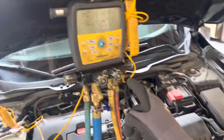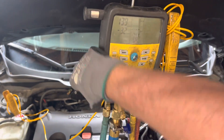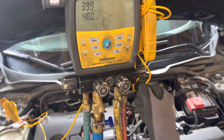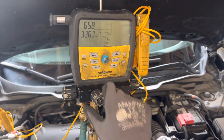So now I'm going to run nitrogen through it three times, flush it, and put it back under vacuum. What I want to do is take out any trace residue of leftover R134 out of the system, so when I put my brand new, clean, fresh gas in the system, it doesn't get contaminated.